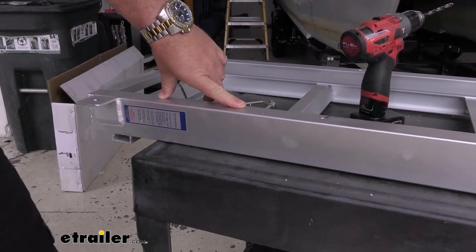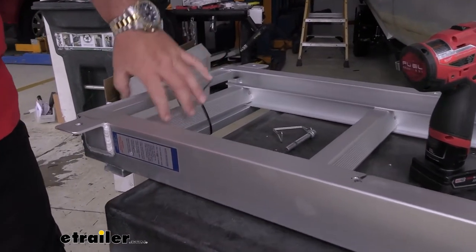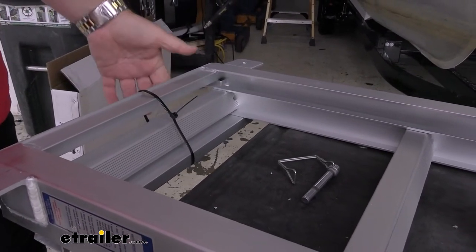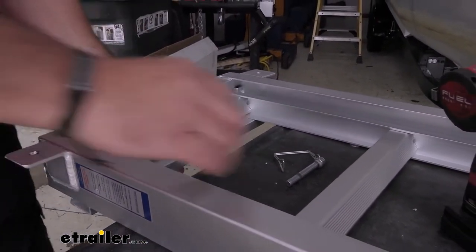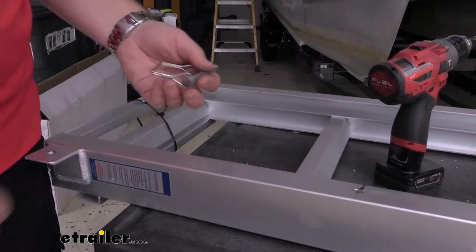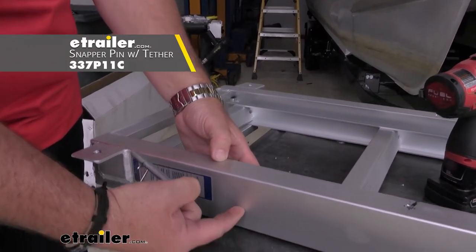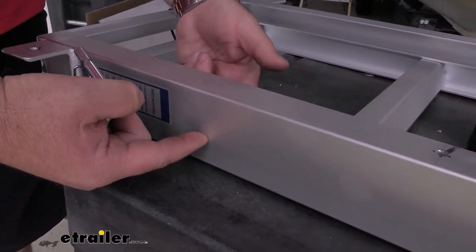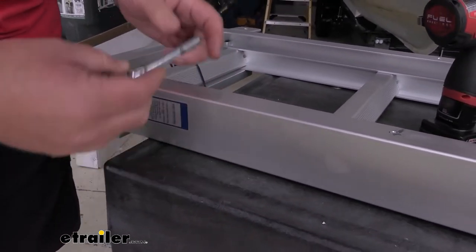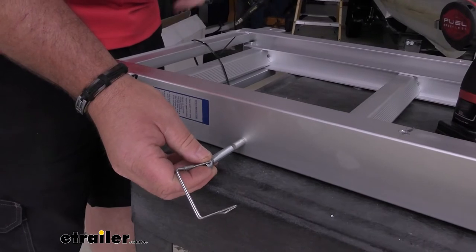Now before we clamp our ladder up to the underside of the pontoon, we're going to take one more step. If we didn't have this, the ladder doesn't lock in here — so if you're on the boat and have to stop real quick, this ladder is going to slide out. To keep it from doing that, you've got a couple options: you can put a strap around here, or you can get a snap pin with a tether on it, which is what we're going to use. We're going to drill a small hole here and through the actual ladder, then take a self-tapper and attach the tether to it and then to the snap ring. This will allow us to lock the ladder in place while we're traveling.